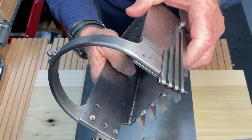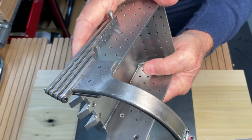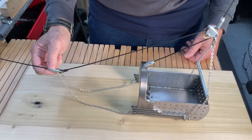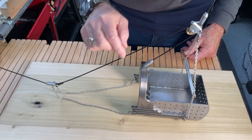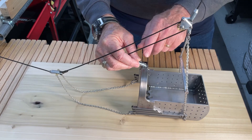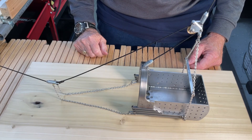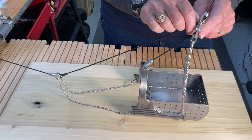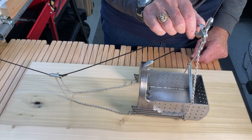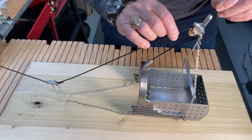Each of the various components were drilled and tapped for attachment to the bucket body with countersunk 4-40 flat head cap screws. The drag link, lift link, and dump link were each machined from 3/8-inch diameter aluminum rod, each having a hidden knot compartment in order to appear more like a cable wedge socket. The dump block was designed as a standoff, scale-based on downloaded photos, and is comprised of aluminum center and side plates with a brass sheave that rotates on a 1/8-inch diameter ball bearing.